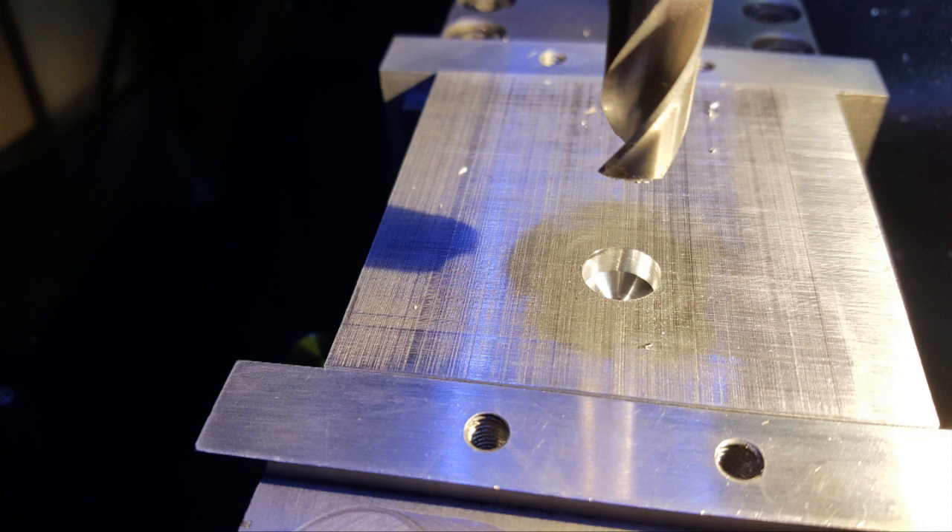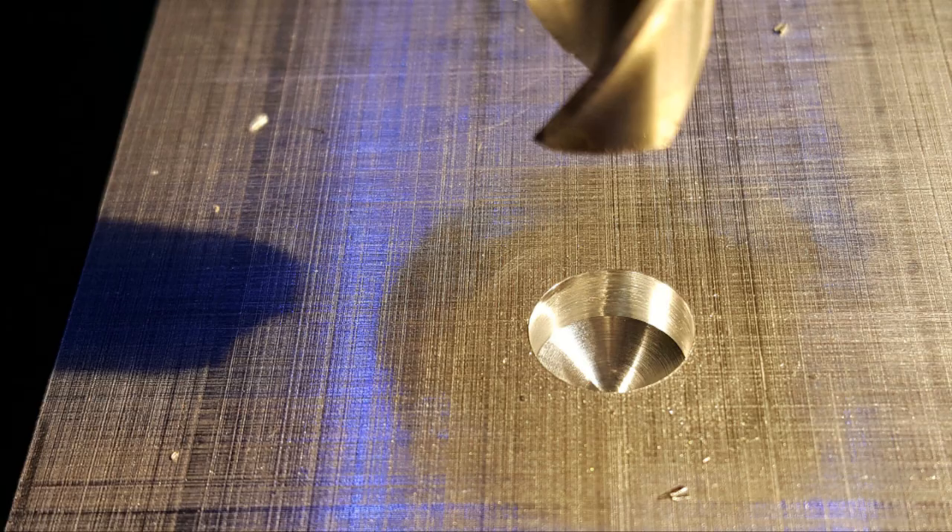On all these holes I expected to have to take the tap out — I didn't. It just went all the way through. I tried it while drilling too, and this is definitely one of the best finishes I've ever seen. The stuff is so thin — water is more viscous than this. It flows so easily it's hard to limit the quantity you're applying. It also has a very funky smell, and soap does not get rid of it — that smell stays on your hands for a day or two.